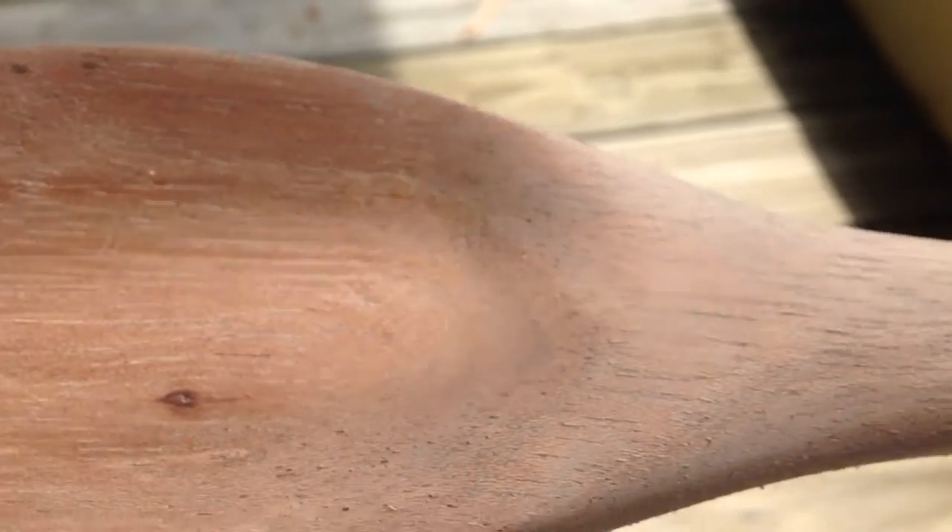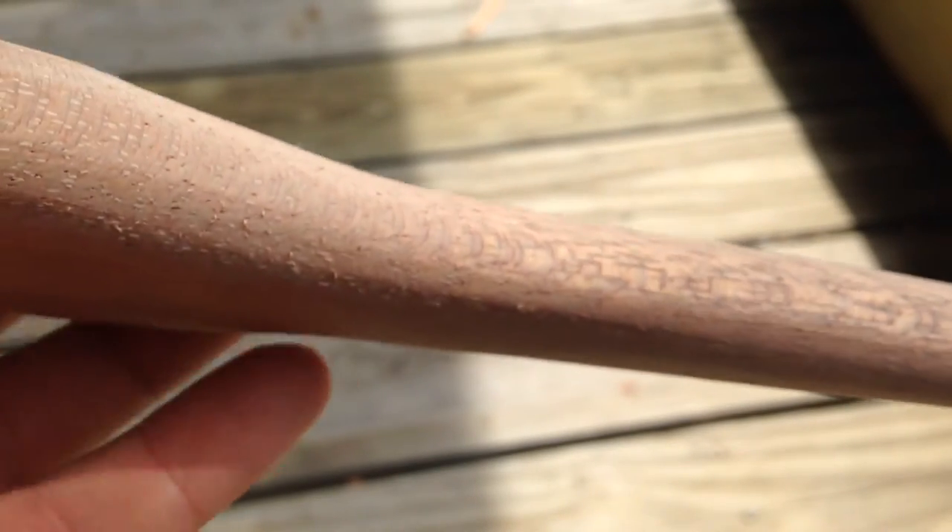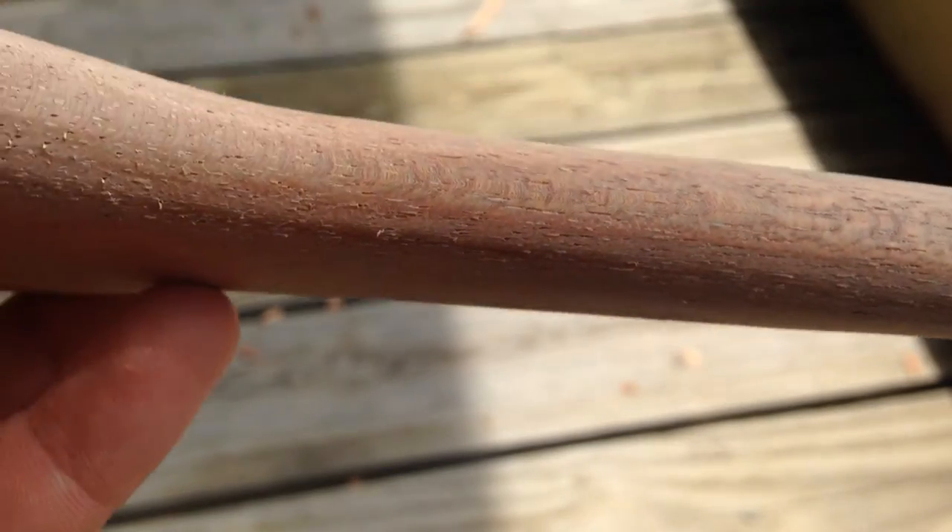Just keep in mind you want to go with the grain when you're sanding these, and progressively get higher in your grit number — start with the most coarse, whether it's 40, 60, or 80, and then go up to 100, 150, 320, as high as you want to go. That's it — hope you guys like the video. Remember to comment, like, and subscribe, and we'll catch you in the next video.